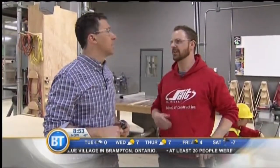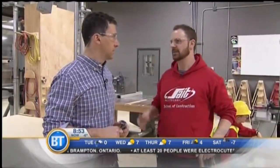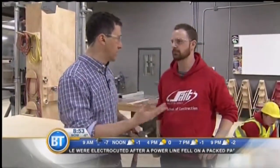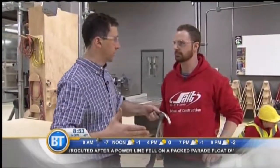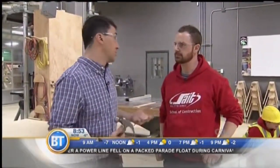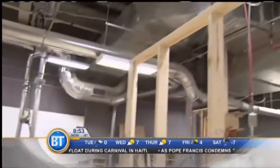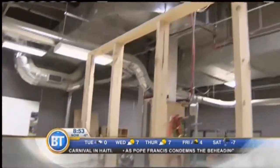it's going to cost a little bit less, you're also going to be able to get more insulation in the wall, which is going to, in the end, cause things to be a little bit more energy efficient. Ah, interesting. So there's a trade-off. It may be a little bit stronger, but the R value is not necessarily as strong as one with 24 centers. So no really right or wrong. It's kind of whatever you decide in the end. Exactly.